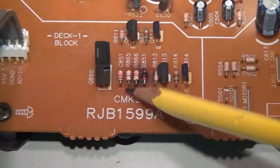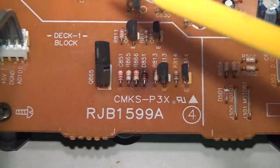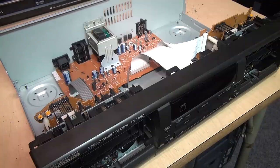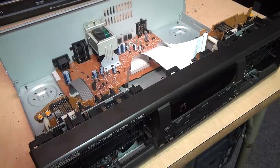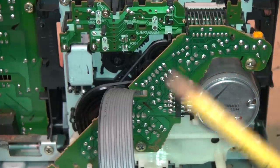I think I found the culprit — that diode looks burnt, along with some other components. It's possible the diode shorted to ground causing the voltage regulator to fail, or the voltage regulator shorted causing the diode to blow. The problem is you can easily get cascade failures where you replace those two components and they fail again because the actual problem is further down the line. On older and simpler cassette decks, problems are basically mechanical — belts, idlers, motors — but on these highly integrated computerized decks from the 90s, you can also easily have electronic problems, making them far more challenging and less likely to be worth repairing.